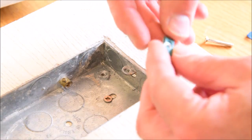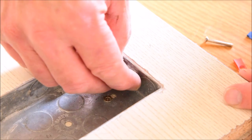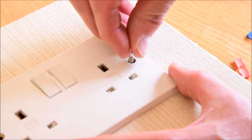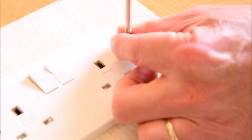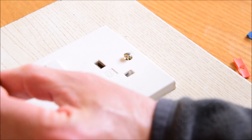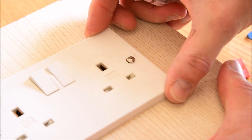So again, as we saw in the earlier part of the video, squeeze the sleeving, slip the backbox saver over the lug and just engage the screw like so. Put the other screw in, and we should now see that we've gained a good amount of adjustment.